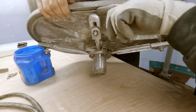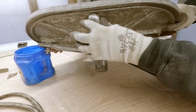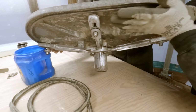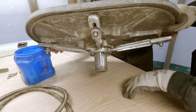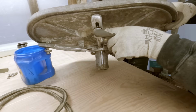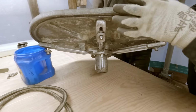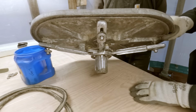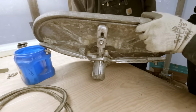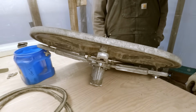So now you can kind of see, the ring that's mounted on the deck goes underneath here, and that's where the dogs engage and compress this. As it's tightened, it compresses that, which compresses the gasket and makes a tight seal against the metal ring that's mounted permanently to the deck. So once we get the gasket reinstalled, the final thing to do is to adjust these, and basically somebody just goes down there with a flashlight, you lock them in, he tightens it up until it's easy to engage, not too hard to engage, and then you just blast the hatch with water and you can tighten this up until it stops leaking. That's the fun part. And then you just check to make sure that it's easy to open and close, and you should be good to go.